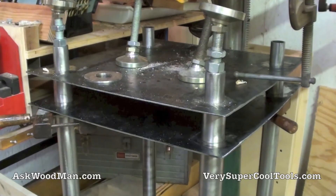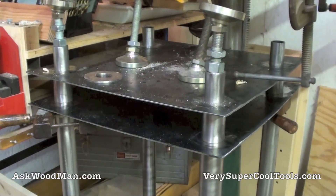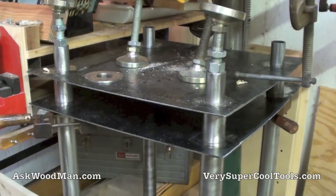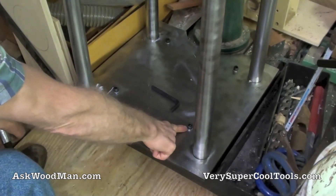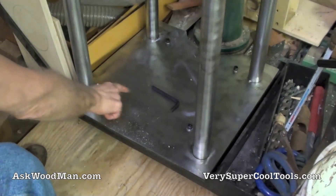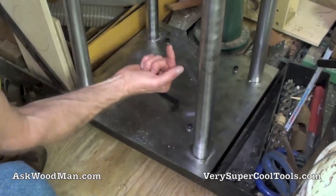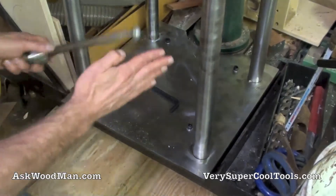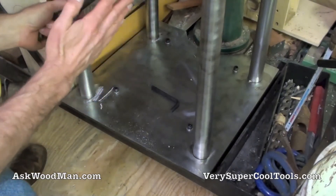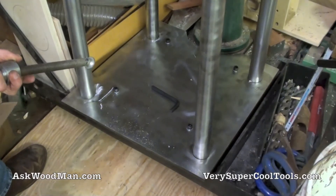A great place to toss drills, taps, and all kinds of things. I'm going to pull this apart and drill these holes out. I think the next time it goes together, it's going to get welded. I'm also going to drill these holes out a little bit — they're drilled 1/64th over 3/8ths — I think I'll drill them out to a half inch and switch to a hex head bolt that's a little longer, then use a bigger stouter washer. A couple of my bolts are cocked sideways, but the casting was not accurate — my layout was accurate but the two slots were not exactly parallel. I need to open these holes up for a little more adjustment and take up the slop with a washer.